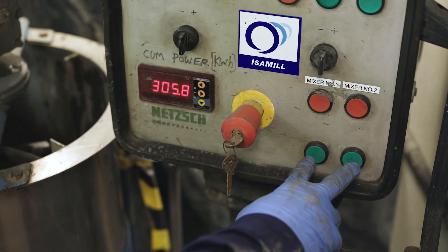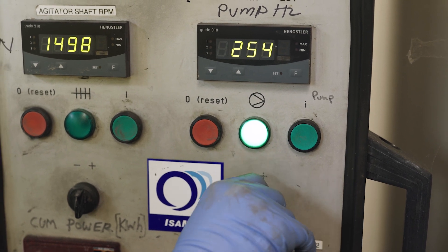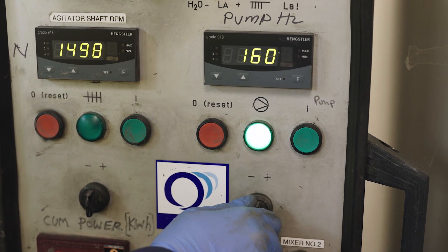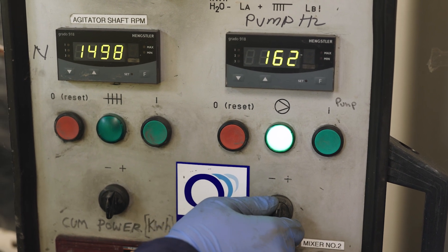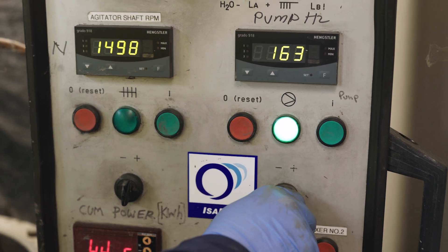Activate the pump and set the speed to the desired flow rate. Glencore Technology will advise you, the lab, of this condition. Water should now be recirculating into the one tank. The flow rate of the slurry is inversely proportional to the product size, so a lower flow rate will create a longer residence time and higher energy input, giving you a finer grind size.